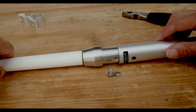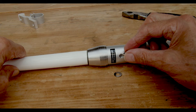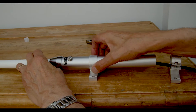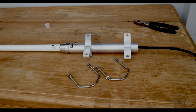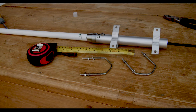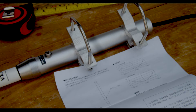You first need to pass the coax feeder through the alloy mounting tube and then attach the connector to the antenna. This also acts as a weather protector — you slide it up to the antenna and fasten it with the bolt provided. Two cast alloy brackets are provided; you slide those up and space them on the mounting tube. That completes the assembly, and there are two U-bolts provided which will accommodate masts up to two and a half inches.